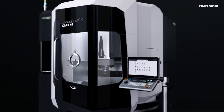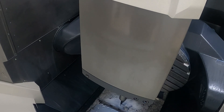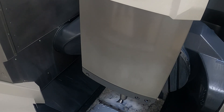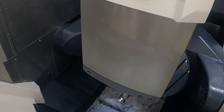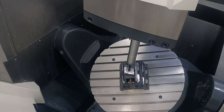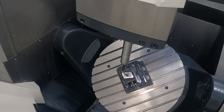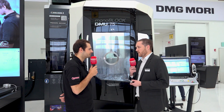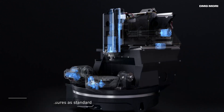I'm sure people are excited to see what's different underneath the covers as well. We've redesigned the A-axis gearbox and the C-axis gearbox — essentially now they're capable of continuous run. We can run the C-axis at its max RPMs continuously without heat build-up or growth. We've also combated thermal growth with extensive cooling added to the Z-axis and other parts of the machine, and we upsized the chiller to maintain thermal stability.